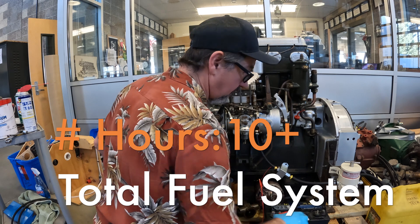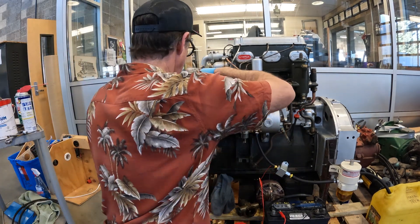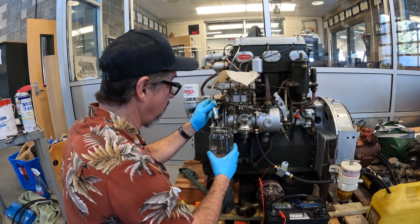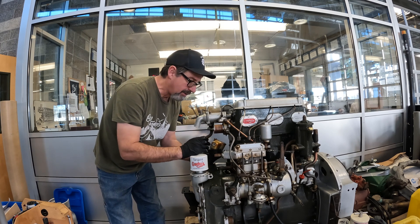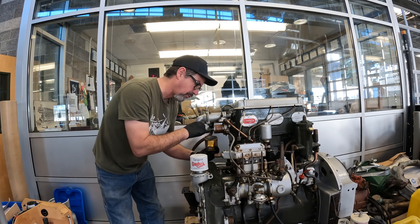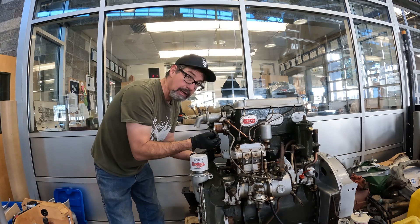The whole fuel system is taking a lot longer than I thought. With our 6LW we didn't do anything with the fuel system — we put clean fuel in, added a filter, and lit it right off. It's clear now — it was like I suspected. There's a nut in there and the threads are boogered up; somebody just put a bolt and nut in without fixing it right. It needs some work. The filter element looks really good though. We'll need to put a new gasket on it, reassemble it, then we'll be ready to bring fuel down into the fuel delivery system.